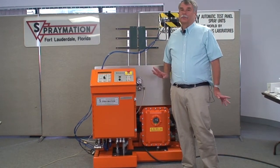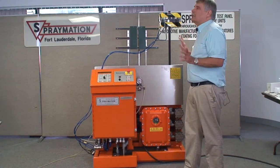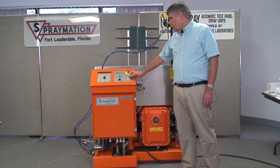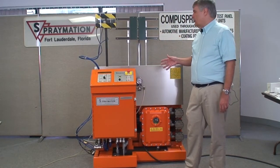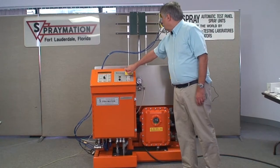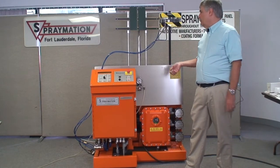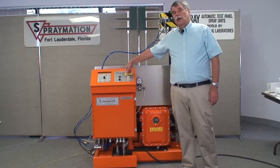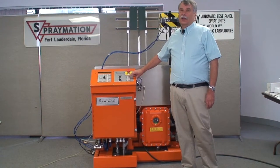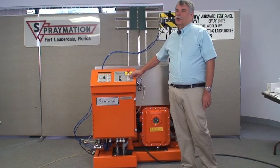The machine starts suddenly without any real warning, but the cycle active light has been blinking the whole time. You can push stop if you need to stop the process for some reason, but it's only stopped — you should not be touching anything if you push stop. If you push stop in the middle of a painting stroke, when you push start again to restart it, you may lose part of that painting stroke. If you push emergency stop during a waiting period or dwell time, the timer keeps running, and when you pull out the emergency stop you have to push start again to resume — no strokes will be missed.